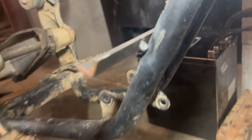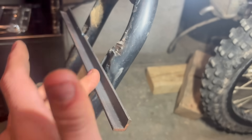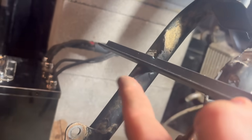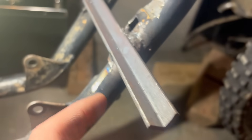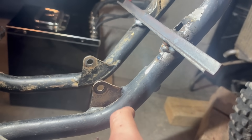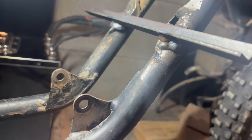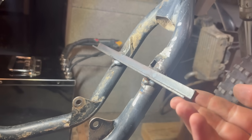I went ahead and got it tacked on — some really crappy tacks — but I couldn't get the paint sanded with the battery in there. Now I'm going to sand it and do some proper beads here, here, and down there. They ain't going to be clean, but they'll be strong. They ain't clean welds mainly because I couldn't get this paint sanded fully, and this paint is thick — it was burning off. But it's strong; I don't think it's going to break. Should be perfectly fine.